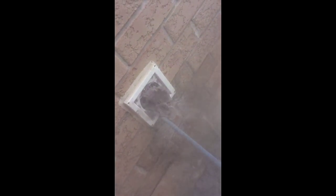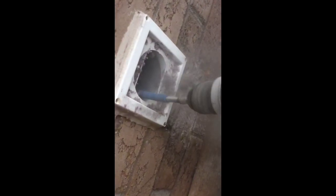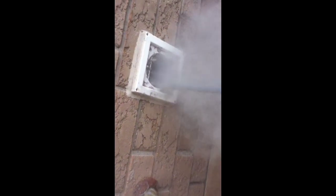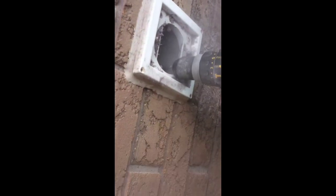This was a tricky one, that's why we're doing it from the outside. There's a big clump of lint — this was a 20-22 foot run. Below you can see all the water damage; the bricks are all damaged from where the damp air was dribbling out and has affected the brickwork over the years.